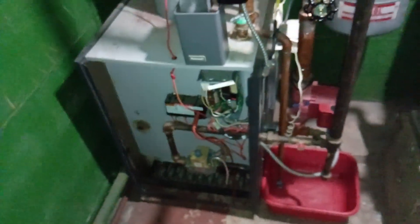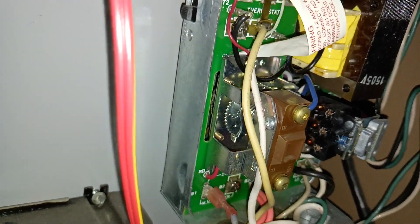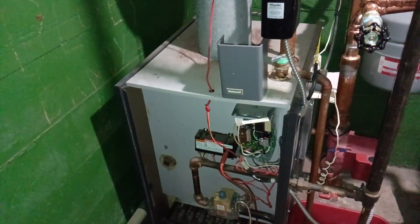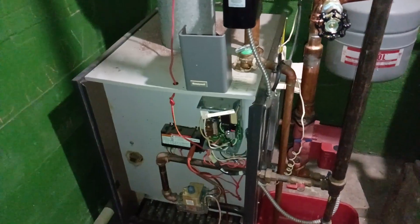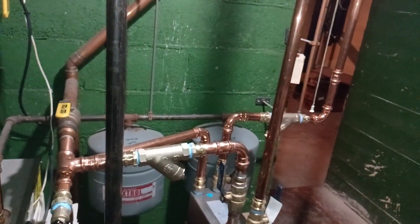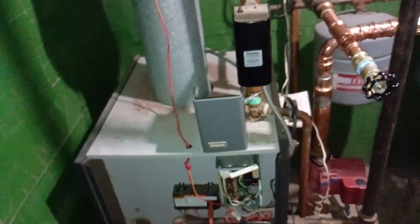There are different setups with different controllers. Looking at ours here, there's a little dial, and if we get in close enough you can see temperatures — that sets the high temperature limit, meaning the limit at which we kick on the boiler to obtain that temperature for the water. I was able to turn that temperature down quite a bit, down to about 140°F — or at least that was the goal. The water coming in from the outdoor wood boiler is coming in between 185 and 170°F, modulating between those temperatures. We'll lose a little getting to the heat exchanger and in the transfer, but ideally we'd never get as low as 140°F.